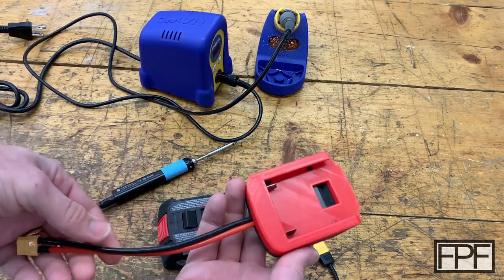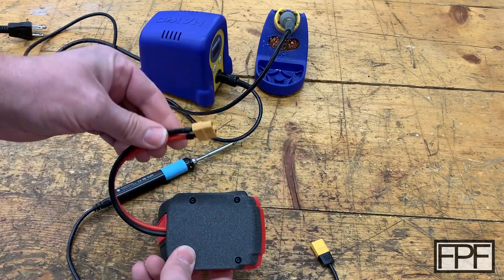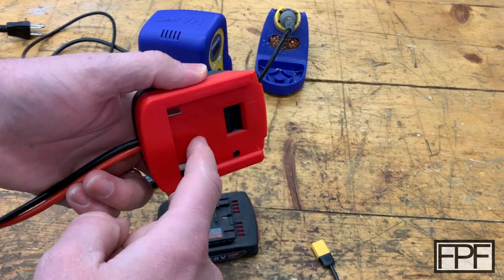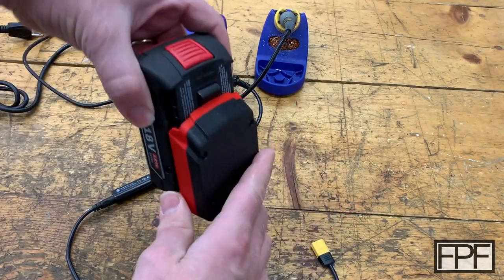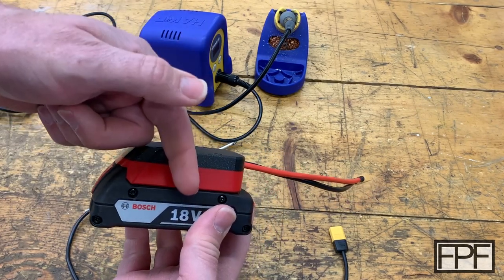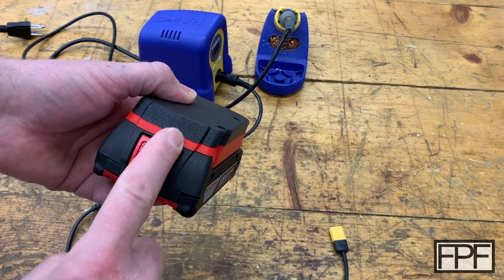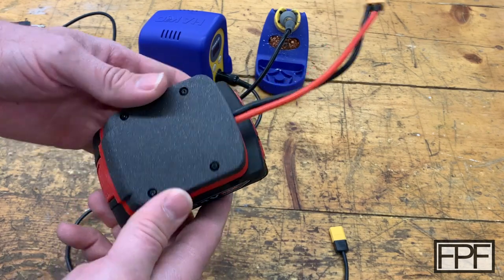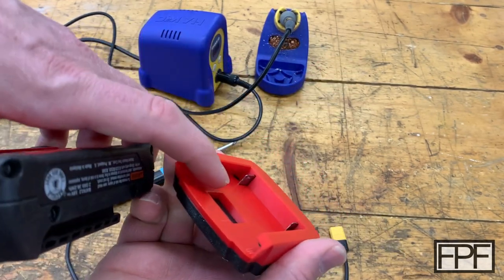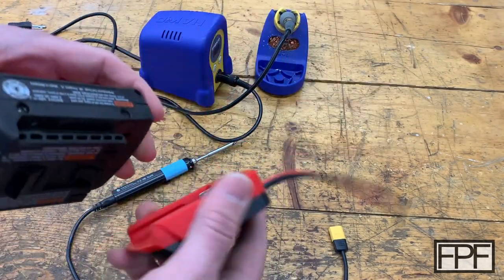Here's what I designed. This locks onto the top of the battery. It's a two-tone print and has an XT60 as the output. I didn't design the bottom piece that locks onto the Bosch battery — I just adjusted the design of one that I found on Thingiverse, and I'll link to the original design down below in the description. I designed this top piece that just sort of continues the same slope here, and inside has hold-downs for the actual connections that go onto the battery. These are stainless steel, and there's routing for the wires, which are silicone as well.